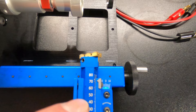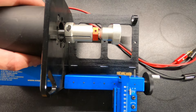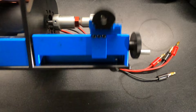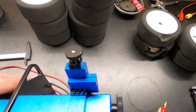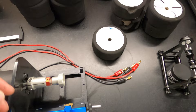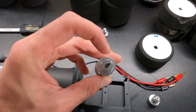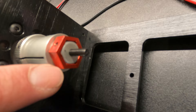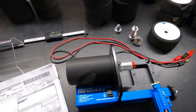When it was stock you were able to do it with this number, but this is made for tenth-scale vehicles and smaller. This line right here is actually where the back plate used to be — I had to unscrew it, drill my own new holes in the bottom, and put it back so it could fit these bigger BSR foam tires. Also, since it's made for tenth-scale vehicles, it has a 12mm hex, but you need a 17mm hex. All you need is a little sleeve — a 17mm adapter. I couldn't find just the adapter, so I ended up buying this whole new assembly.